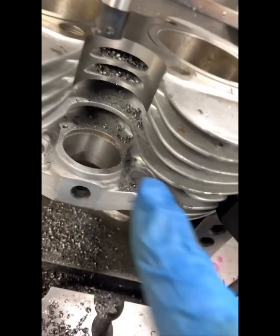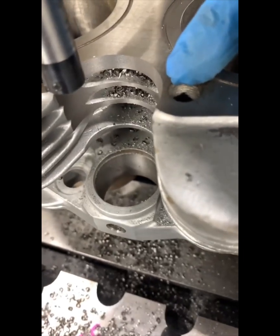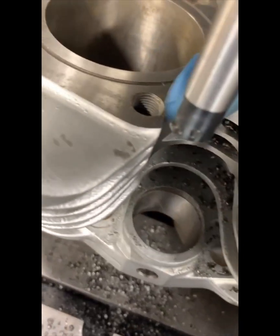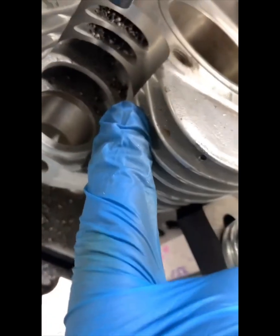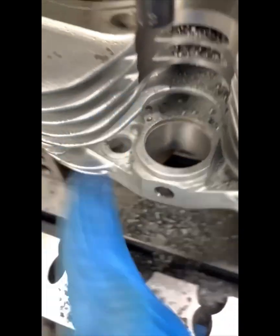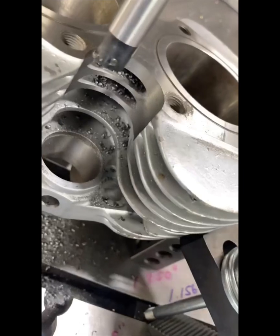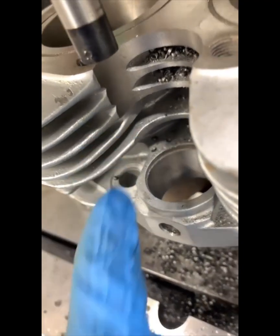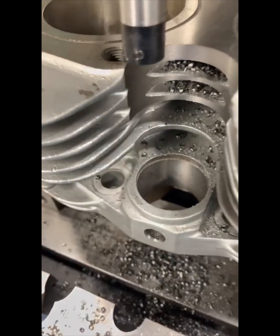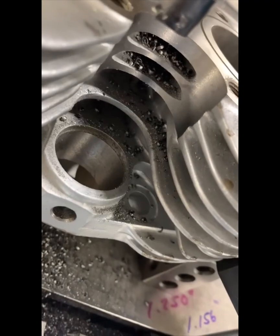So this is what I have so far. You can clearly see it's cutting more over here — not that it's not in the center of the hole, it's just the way the casting is. So instead of removing more material, as you can see we're getting close. It is cast iron and the thread pitch is very fine — I believe it's 26. So I'm going to stop. I'm still touching here and still touching here, so I'll get my porting carbide bit and literally just remove material in that area and blend it in. It's not going to be seen because there's going to be a push rod tube. On both sides in this area — and now that this is open, there should be no issue getting my tool in there and actually laying down the push rod tube. Let's go ahead and mark this up with some red dye and open the clearances up.